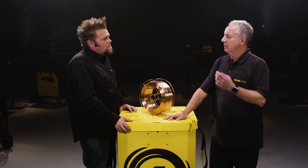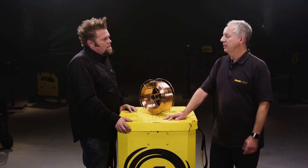How can you say that about just a simple welding wire? Here's how we can say it, Ian. We've got an enhanced copper coating process now for our Purus wires. It results in a very smooth feed, much improved tip life, less copper flaking in the liners, and therefore you get more uptime and a better looking weld. So let's talk a little bit about each one of these claims. We can break them down.